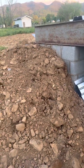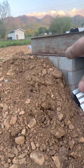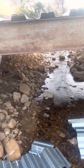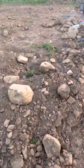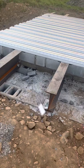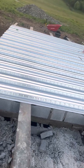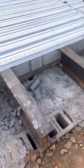I would also add wings on the outside front and back of the bridge. You may think, like I did, that you don't need wings on the back — but what happens is the water comes off the corner of that block, swirls right there, and digs out the foundation. My water is slow and only comes up maybe twice a year, so it's not a big deal for me. But if that's not your situation, that swirl can cause major issues. Also, when pouring the solid footers, I had to wait a long time for the water level to drop so I could lay block. If your water level doesn't fluctuate, that's going to be much harder. One solid pour for the foundation makes things a lot easier.